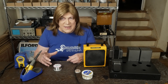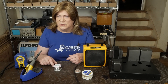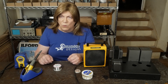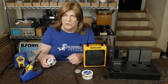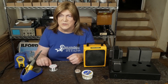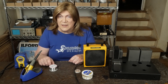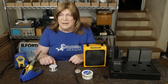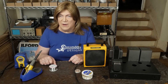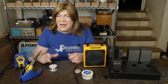The main thing I noticed when I took it apart was that the solder joints just looked bad. When I went back in to work on it, I don't know what kind of solder he was using, but it was impossible to get old-school solder to stick to it. I ended up having to throw away most of the tag strips and tube sockets because it was just a hot mess. I asked him what kind of solder he used, and he said he used lead-free solder and then tried some no-clean solder — and I was like, I think that's the problem.